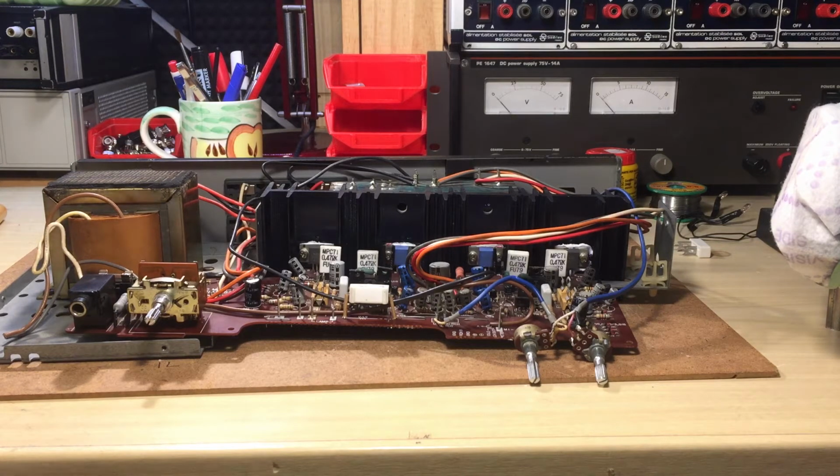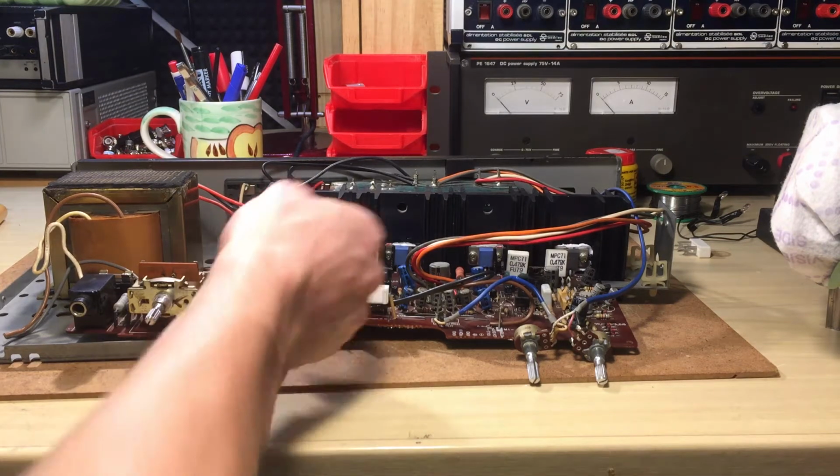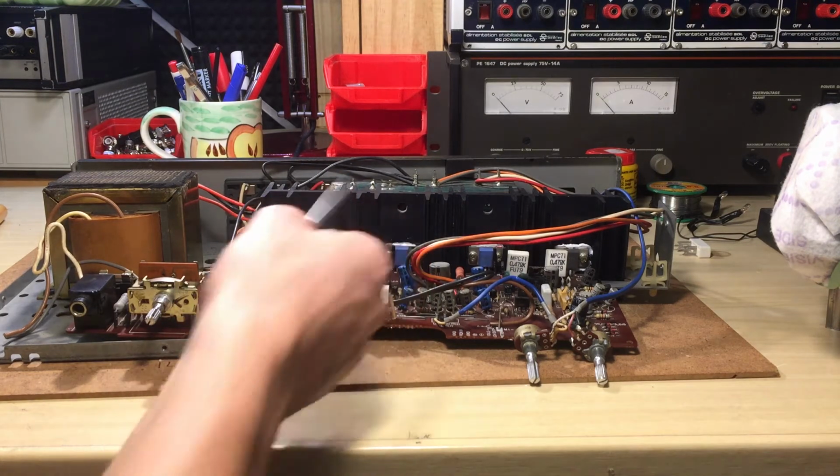And it's a very dangerous situation, because if you just plug in a speaker, as I said, it will blow the fuse. And if you hardwire the fuse, it will blow the speaker because you have a DC component on the output. You should never have a DC component on the output. It should be very low, like 50 millivolts maximum, or even 100 on higher wattage, higher power amplifiers. But those were the first things I checked.